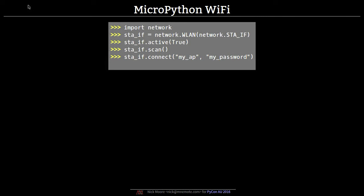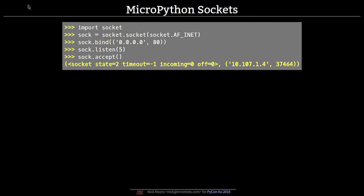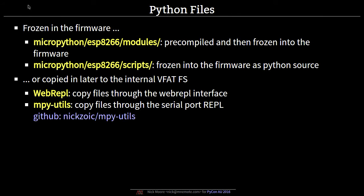The Wi-Fi is very, very simple to set up — there's a bunch of libraries wrapping it in Python. You can easily connect up to Wi-Fi, and there's the equivalent of STA and AP so people can connect to you. Sockets are about as simple as you can get. There is actually a web server project someone set up — a micro web server. You're not going to be running Django on this thing, but it's actually really handy to serve up your application as a web application straight from the device, because many people have phones. You can just point the phone straight at the thing, load it as a web page, and then it can do web sockets or an HTTP POST to control what the hardware is doing.